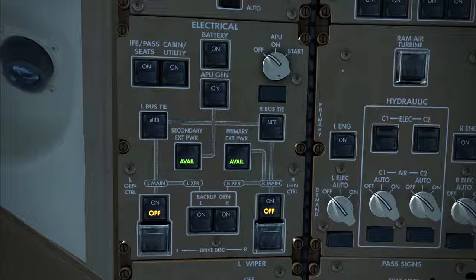An interesting piece of trivia: although the 747, 757, 767, 777 and 787 aircraft have this type of switch plastered all over the flight deck, the 737NG has only 4 of these switches. The EEC switches on the aft overhead panel and the cargo fire armed switches on the aft electronic panel.